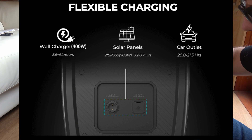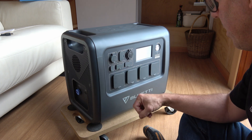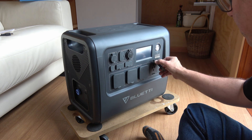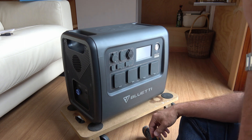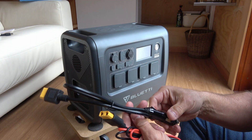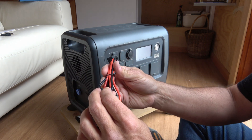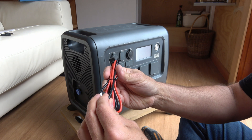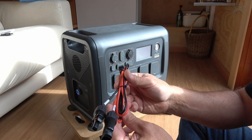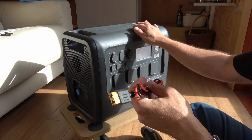Interestingly, this is the 240-volt version. I see people complain about these rubber covers — I think they do the job. They're a bit floppy. I've seen people rip them off, but they keep the dust out at least. Your cables all terminate in this XT90 — that's a nice big solid cable. The MC4 has 14 AWG cable, rated 600 volt, 200 degrees. I think that's more than adequate for what the limits of the device are.